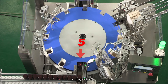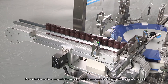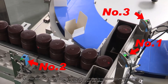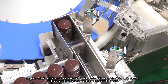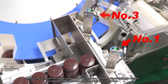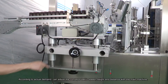Working Station 5 Manual Working Procedure: Push Bottle On. Auto-Feeding Bottle Device: put the bottles on the conveyor belt manually, and the conveyor belt starts to send bottles automatically. Number 1 sensor detects bottles coming. Number 2 sensor starts to count and accumulates to 5 bottles. Start sucking the box into the star wheel. The pushrod will push the bottles to the bottle feeding station. Number 3 sensor checks the bottle on spot. The feeding buffer opens and the bottle is put into the box. According to actual demand, the conveyor belt speed, height, and distance with the main machine can be adjusted.